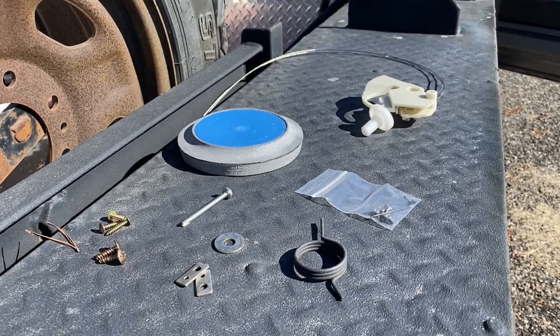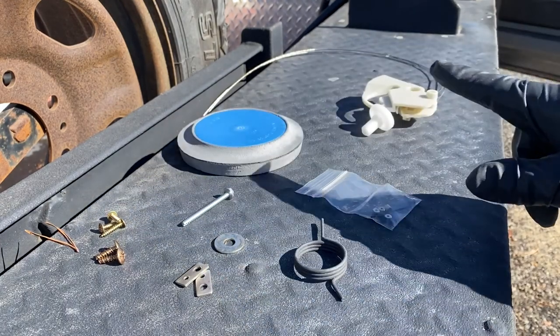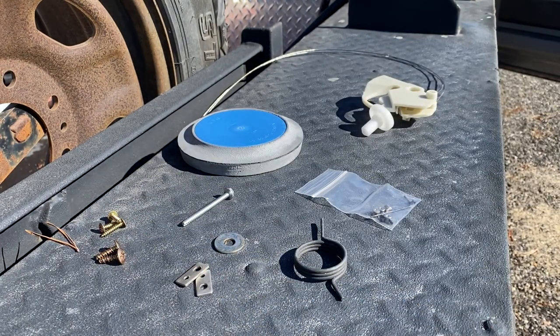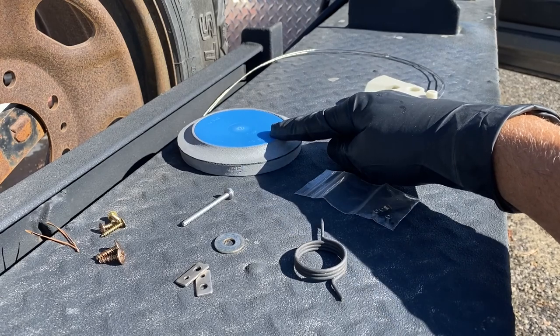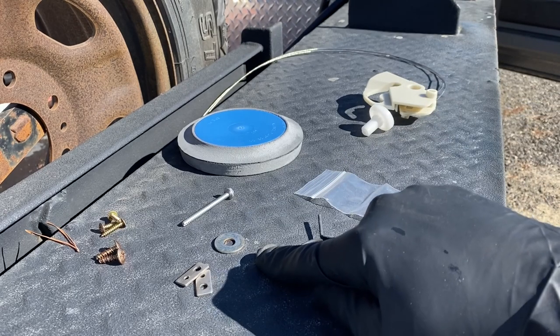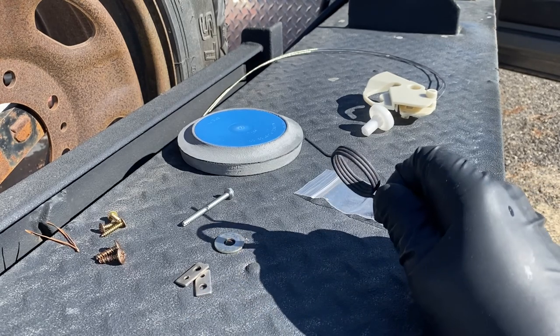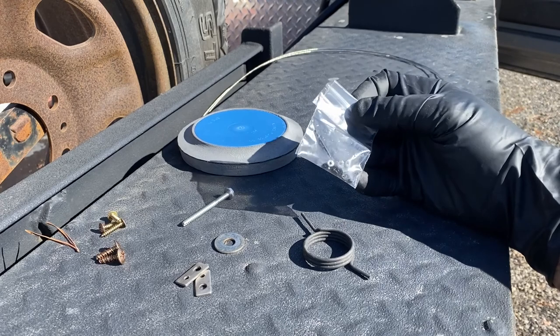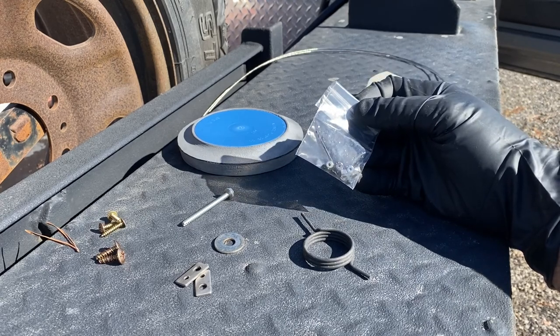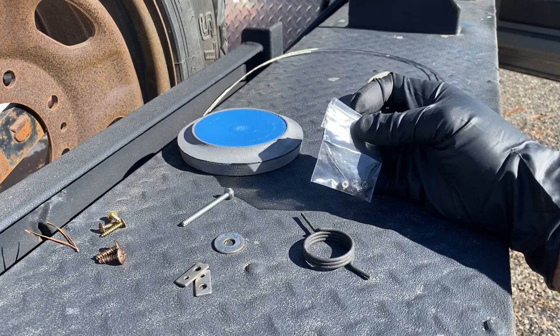When you open up the kit for the wire replacement, this is what you get. What this includes is some ball retainer screws. You've got your mechanism cover screws over here. You've also got a closet flange to replace the one that's on there now. You've got your lever and arm assembly with the cables attached. You've got this washer. You've got these, which are called ball retainers. And you've got a lever return spring that you can replace. Inside this little package, you'll find an Allen wrench and also the wire retainer collars and the little wire retainer set screws all in one little package.